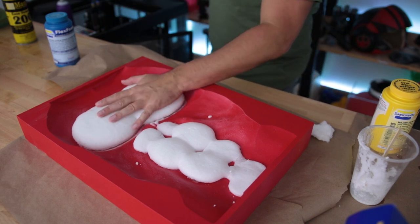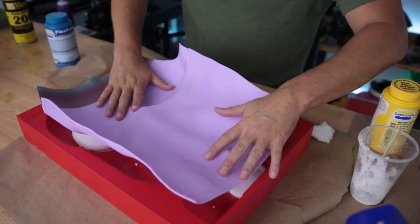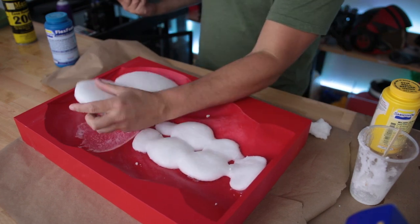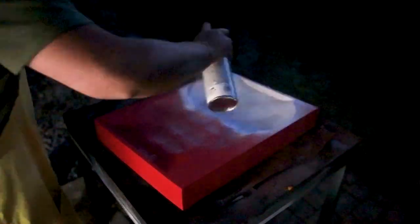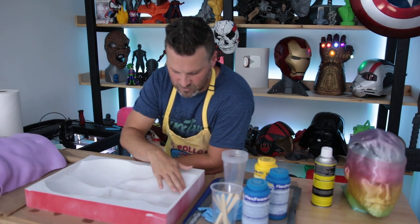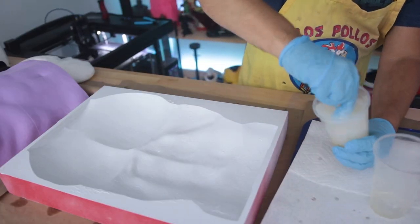After looking at this, I realize I can't have it fill up the full cavity — it's going to protrude too far from my body. So what I'm thinking is laying down the foam and then inserting the 3D print on top to press it so it forms a thin layer of foam around the mold. I do know that what I have right here is already a lot thicker than what I'd want if I'm actually going to wear this. To help seal this, I put down heavy coats of primer filler paint — two or three applications — and sanded away excess foam to smooth it out, then put down more spray again.